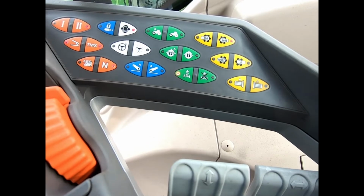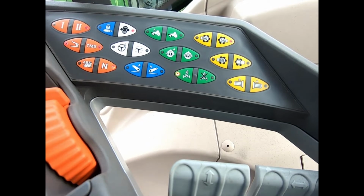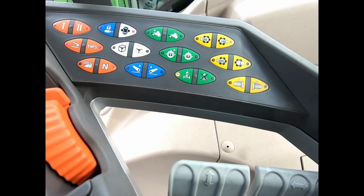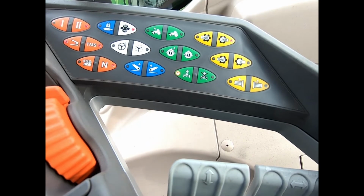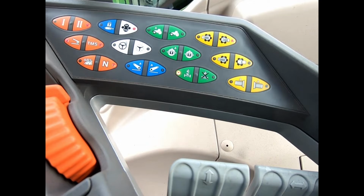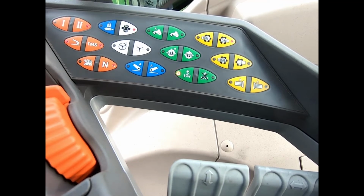As part of the safety regulations, the tractors will have a proximity switch underneath the seats, and what that means is if I've got the PTO running and I get off the seat, then the PTO will stop running. Now sometimes there might be a situation where I want to keep the PTO running, and the way that we do that is I've got to meet some criteria first.